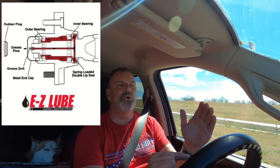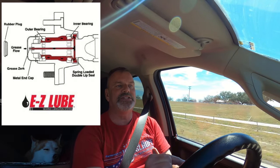Now, another thing is the blowouts. If you noticed, and I don't think I emphasize this enough, you are recommended to rotate that tire, and that's why we lifted it off the ground while I was filling it up with the grease. You want to do that so it distributes evenly. And there was a very good video that we found on YouTube. I'm going to see if I can find it and maybe put that in the description below. It showed you how the EZ system was taken off and where that grease goes. There's a little hole that comes out in the spindle. And the reason you're rotating that tire is so it evenly goes in there.